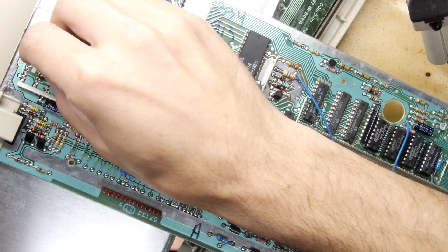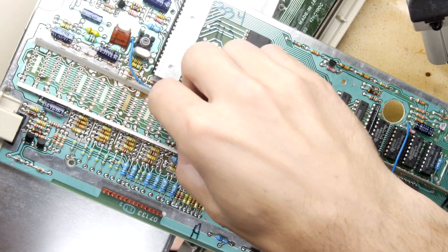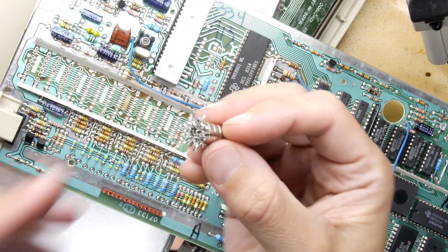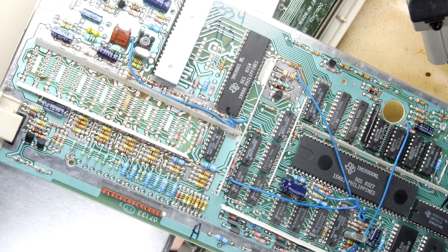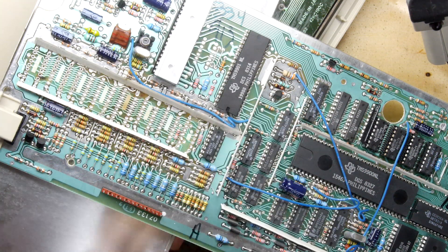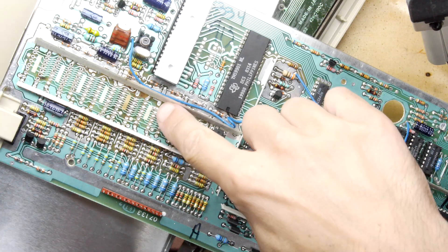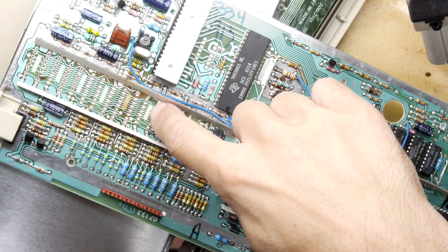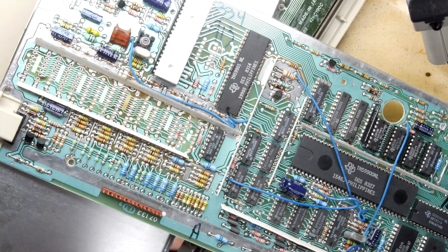Just make sure you run a little magnet up and down to catch all those pins, then chuck them in the bin, just like that. Have a look out, keep your soldering iron on — or put your soldering iron on if it's not on — and just grab any of these last little bits that haven't removed themselves from the board.